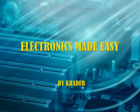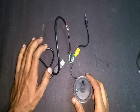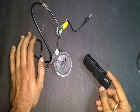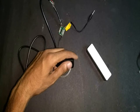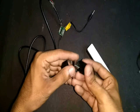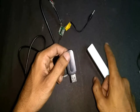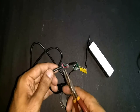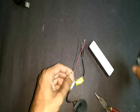So let's not waste time — let's get started. For this we'll be using the 3-watt amplifier from our last video. Along with this, you'll also need a power bank — anyone will do, but I am using a Zebronics power grid series power bank I've been using for nearly a year and thought I'd give it a new life. You'll also need a stereo Bluetooth audio receiver like this one. It has a USB on one side and a 3.5mm audio jack on the other. First we'll start by cutting away the USB cable from the amplifier, separating the wires, stripping the ends, and keeping them aside.